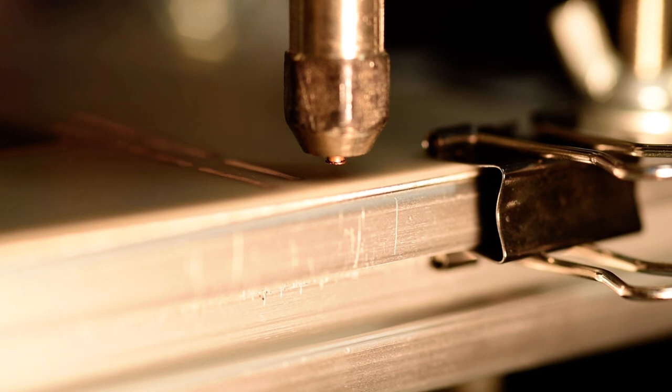This is test number one of 1.6 mm diameter copper wire on 99% aluminum nitride medium polish at 30,000 rpm and a surface feed rate of 75 mm per minute. We have an XZ feed ratio of 80, which means we're traveling 10 mm on the surface to 0.125 mm in Z plunge.